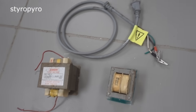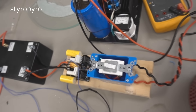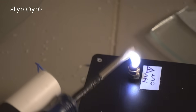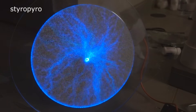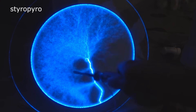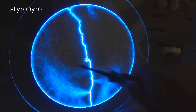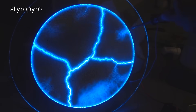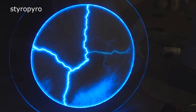Learning is fun. In terms of AC power supplies, I have a lot of choices, but I think something high frequency is my best bet. I have a bunch of antique flybacks from the 40s that should be a good choice. I mounted a pair of flybacks inside a box then submerged them in oil, and wound my own primary so I could drive them with ZVS drivers. This setup is capable of making some pretty cool arcs. Let's see how well this setup drives a Lumen Glass fixture. That isn't very impressive — let me try raising the voltage. That's better, at least it's brighter than it was originally. Listen to that hiss when I bring the screwdriver to the glass. That's the highest I can go without blowing my driver, but it really isn't as impressive as I'd hoped. The circuit isn't even drawing that much power. This power supply is doing tens of thousands of volts and has the ability to deliver a lot of current — I guess the impedance of these fixtures is just too high to allow that to happen.